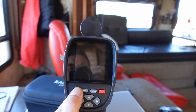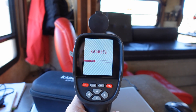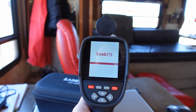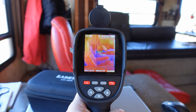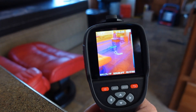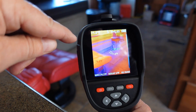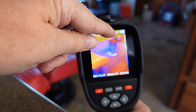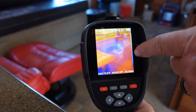Let's just turn her on — hold the button down for a few seconds and the screen boots up. Looks like it takes maybe 10 or 15 seconds to boot up. Let me go through all the settings and the button features. On the display, whatever I'm pointing at in the crosshair shows the temperature in the corner. We also have min and max temperature, time, an emissivity value E equals 0.95 — I'll talk about that in a minute — plus battery level and the color profile.